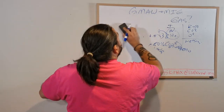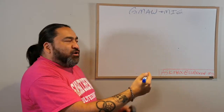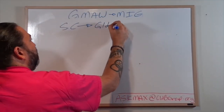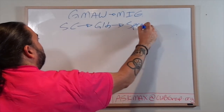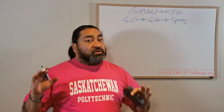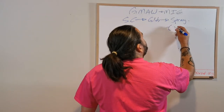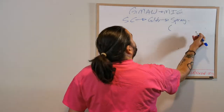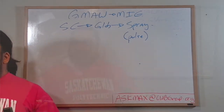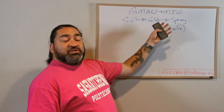Next. We've incorporated the gas. We got our little parameters done. Okay, we got that all figured out. And we said, you know what? We got short circuit. We go up in temperature. We go to globular. We go up in temperature. We go to spray. Okay, and we thought, you know, great. And that's been the majority of GMAW welding for a long time. But things have changed, of course, because the machines have gotten better. Now you'll often see something added here, and we should all know how to use this right now, called pulsed or pulse spray welding. Okay, now in most textbooks now, it's called the fourth. It's the fourth type or process of GMAW welding.